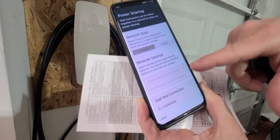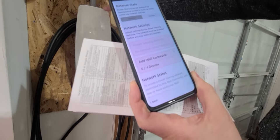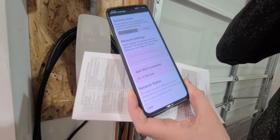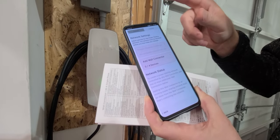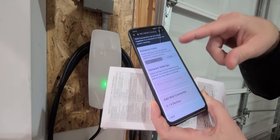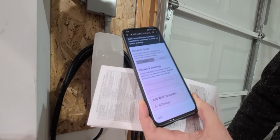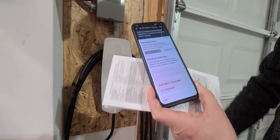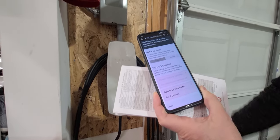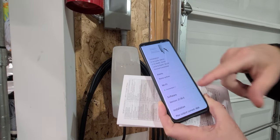And then there's power sharing — this is the thing that the Gen 3 is really good for. It uses Wi-Fi to load balance. Right now I only have one Tesla wall connector, so there's not much to configure. But if you wanted to enable that, you'd hit enable network share, and it would load balance so you could plug in two Tesla wall connectors on the same 60 amp circuit without blowing the breaker, using the Wi-Fi of the connectors.